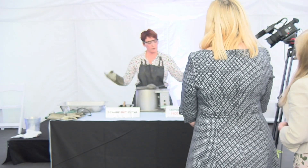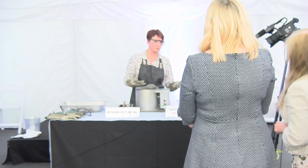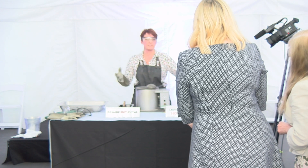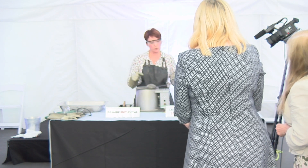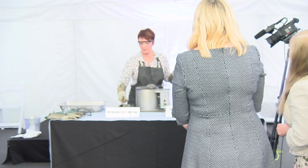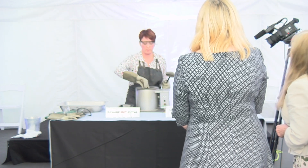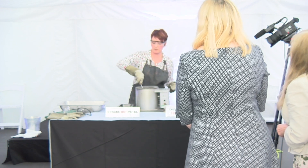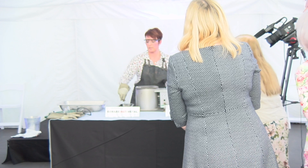When you're putting pewter back in the pot, you may have bits of dust or where it's coming in contact with the air there's a skin on the surface called the dross. You don't want that going into your casting, so just using the scraper, you scrape that off and then you've got nice shiny metal underneath.